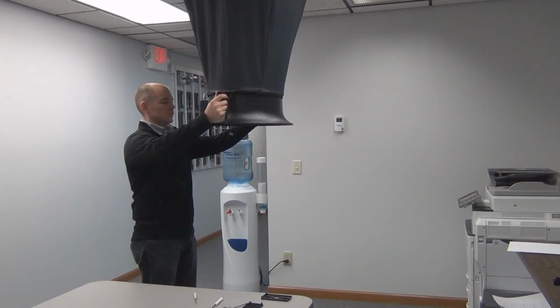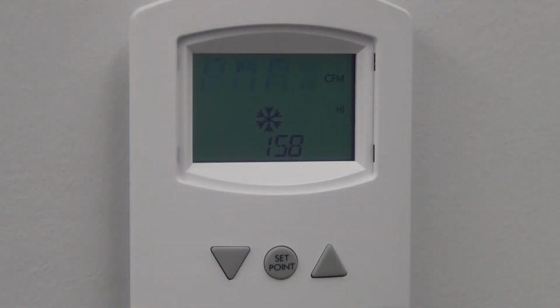To enter this value in the controller, first press the Center button. Pmax will stop flashing and the small numbers at the bottom will start flashing. Use the up or down buttons to enter the actual airflow measured with the flow hood. Press the Center button to save the value and advance to the Pmin display.